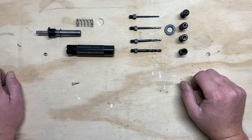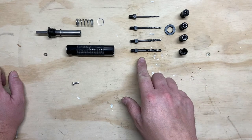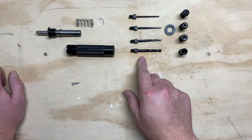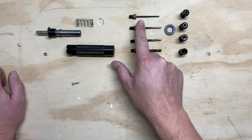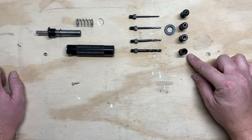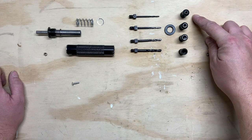This kit is an all-in-one kit. It comes with a number of drill bits: a number 10, 21, 30, and a 40 drill bit, to go along with the corresponding 3/16ths, 5/32nds, 1/8th, and 3/32nds sized rivets.